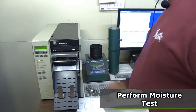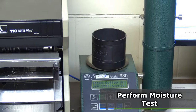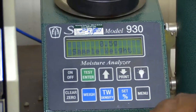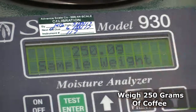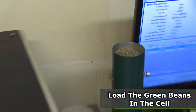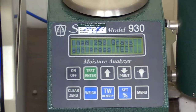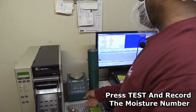Once they're mixed, they go through the moisture analyzer. Turn that on, make sure it's set up properly. I'm going to weigh out 250 grams of coffee. I push weigh — that zeroes the scale. I weigh out 250 grams of coffee and it goes into the analyzer. I push test again — it calibrates. It gives me a message that says load the cell. I push the button, the beans drop into the cell. I push test one more time and I'll get the moisture reading.